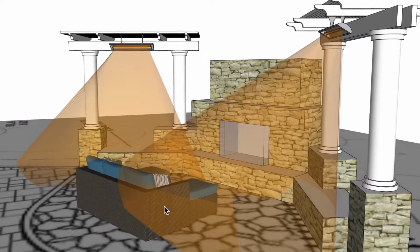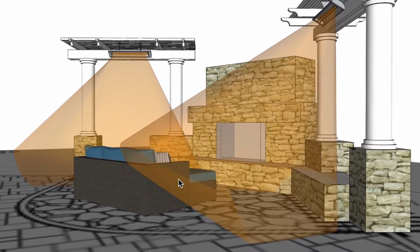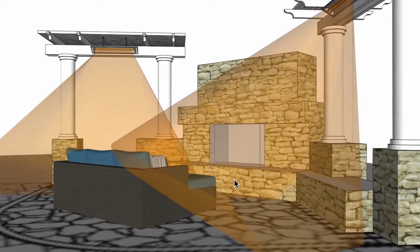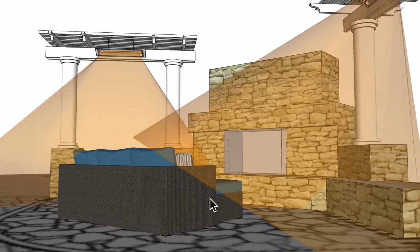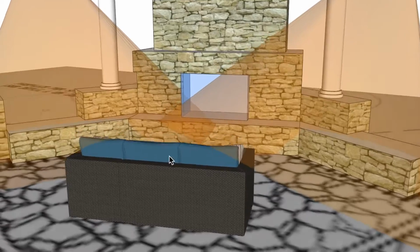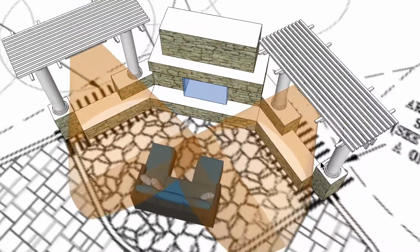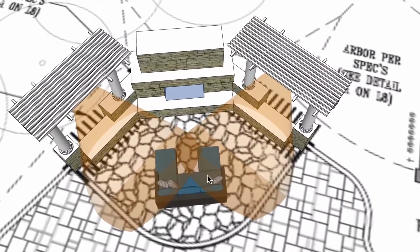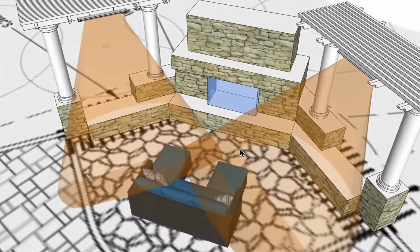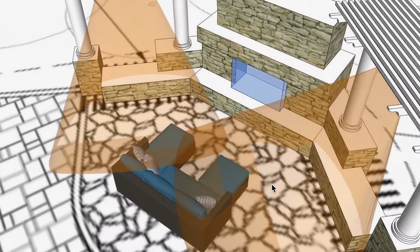And this is about the maximum throw on a 5000 watt unit for a comfortable outdoor area in, let's say this is probably Southern California here. A 10-foot throw is about what you can expect to be the most ideal comfort intensity that you're looking for. But as you go beyond that, you really need to get some overlapping rays, and that's what this is going to provide. You'll see that this is going to provide some overlapping rays so that you are hit from two sides, and the intensity is much stronger with the distance that you're away and the double penetration. So that's what we're looking for.